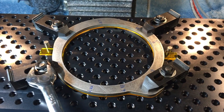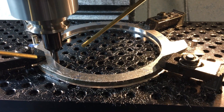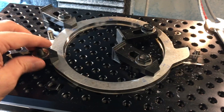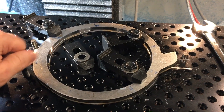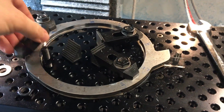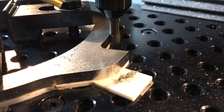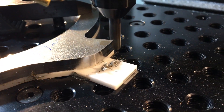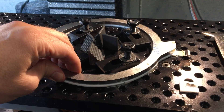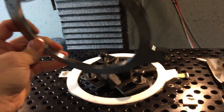I used toe clamps to hold the ring down, then came in to cut that inner diameter accurately. I moved the clamps to the inside and cut the outer diameter and profile using a carbide end mill. Machining the S7 steel wasn't too bad — I wasn't removing a lot of material, less than a millimeter, so I just went fairly slowly. One of the two rings came out well — I messed up one — but one was enough. Then it pops off and the weapon ring is basically done, with a little cleanup. I had it heat-treated to 54C Rockwell.